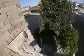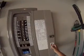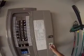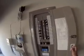There's no grounding bar that I can identify. Okay, it's got grounding at cold water, second ground, blank plate and garage down there, that's the second ground, and then bonding on the gas pipe and main pipes. But it hasn't got bonding on the flue pipes.